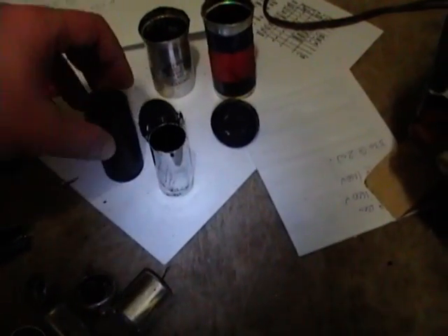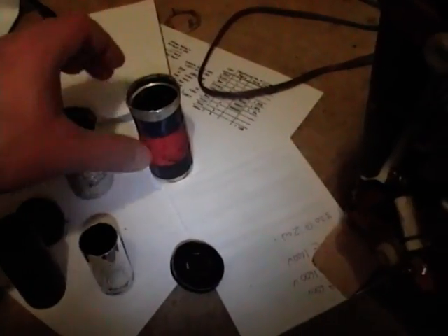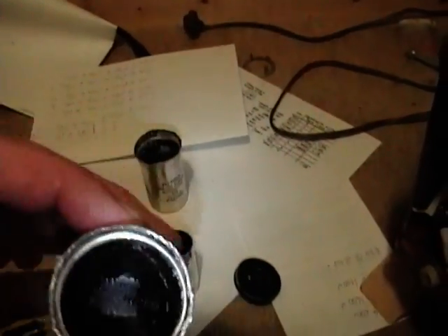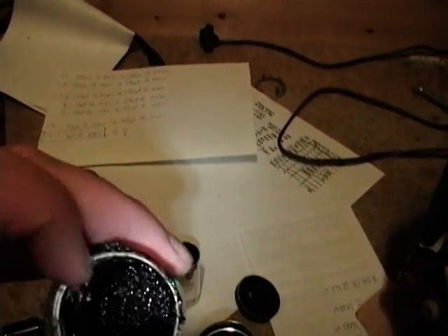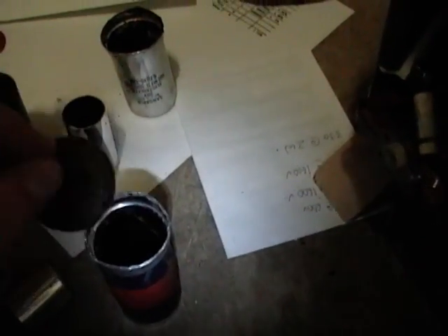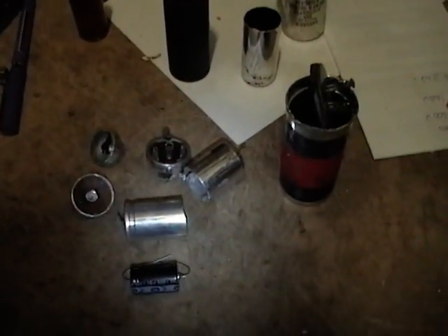I've cleaned all of these out with some multi-purpose 409-type cleaner degreaser, so about all that's left in them is just the tar. If you want, you could use lacquer thinner to dissolve it all out, but it takes a lot of lacquer thinner and there's all this sludge left over — so lately I've just been leaving it. It's hardened, it's not going to go anywhere, and it's not going to hurt anything. What's left is to drill some holes in the bottom to wrap the leads around, put the caps in, put the covers back on, recrimp, and so on. This is the single section that goes here and this is the multi-section that goes there. I'll save that for tomorrow though — it's getting kind of late. That's all for now.